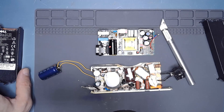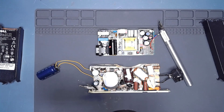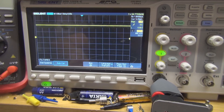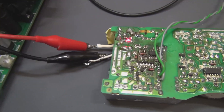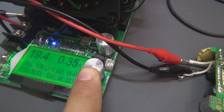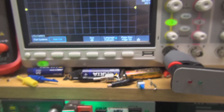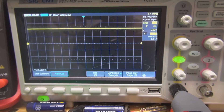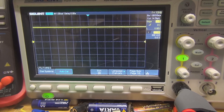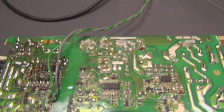That's all for today. I hope you understand my purpose in this video — trying to understand how a regulation circuit works. If you put a scope on the photo diodes on the low voltage side, you will see just a continuous voltage, and at full load you will always have the same voltage on the photo diodes on entry. This was Alexander again — I hope you liked this video. See you soon.